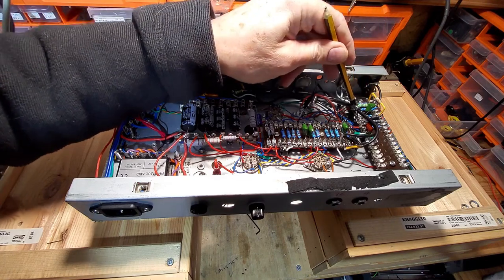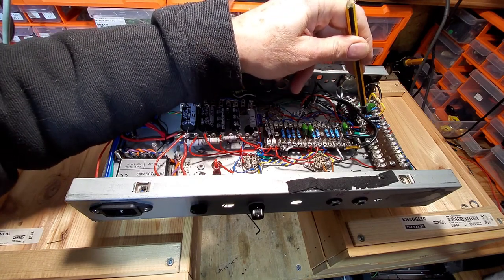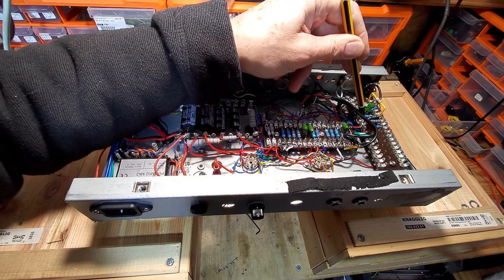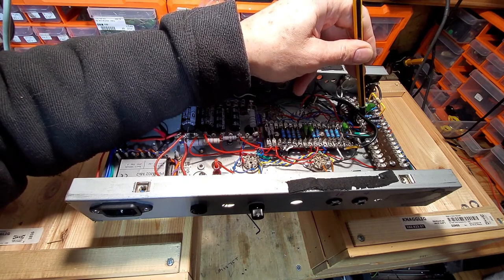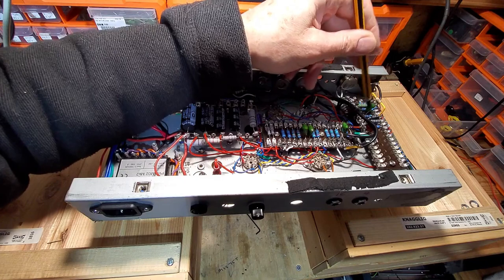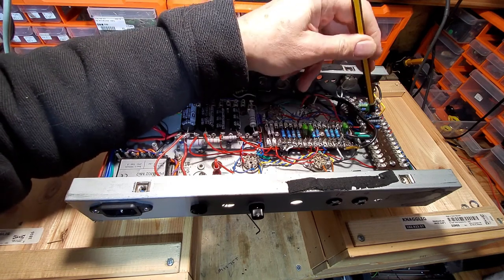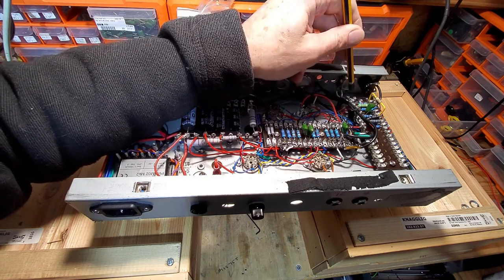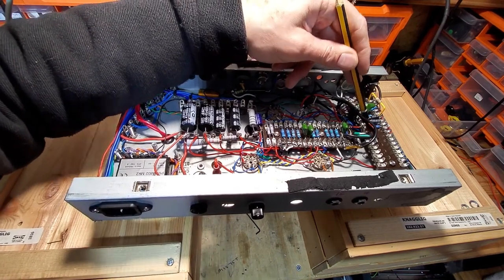So we've worked through, because I've been trying to tame this gain down. I think that's coming out of the second stage, out of the triode. We've got a 470k resistor, and I may up that a bit more. We had a 220 in before, and they get a bit dark when you put those in, so I've put a 470 picofarad across it just to give it a bit more life, a bit more brightness. I had two 820 ohms on the pentode and triode on the cathodes. I've got 820 on one, and I think I've got 2.2k on the other.